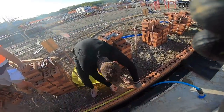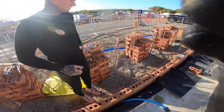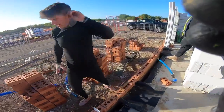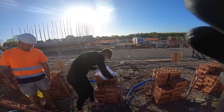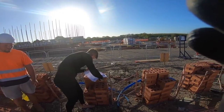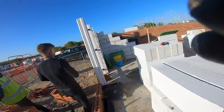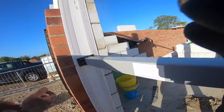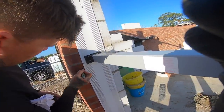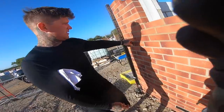So this part here - the height is... Charlie's marked it here. Right, so what side of the side? That's what Charlie was saying - this is a deep one so it's a bit more brickwork, got an extra two courses. I've already marked it on this side - look here, 1050. This is this course here. Can you do a big mark like you did on the other side? Alright, you're running two courses down from this window, look.